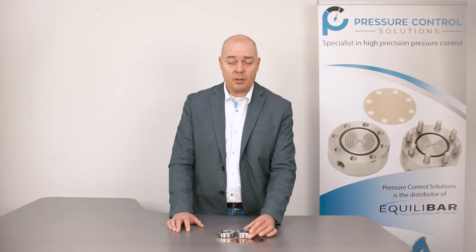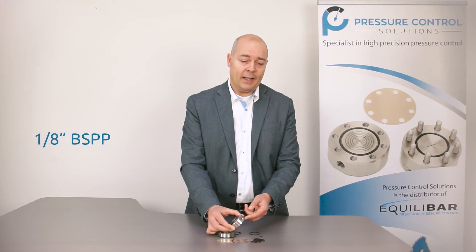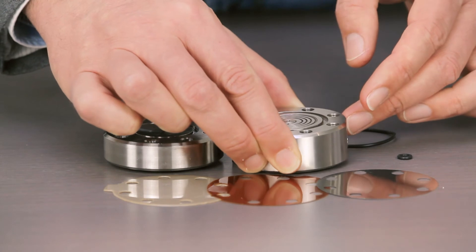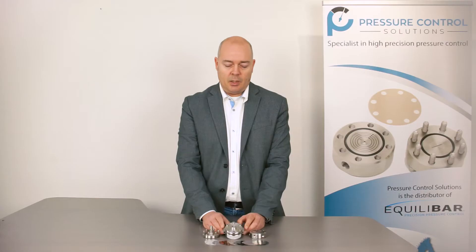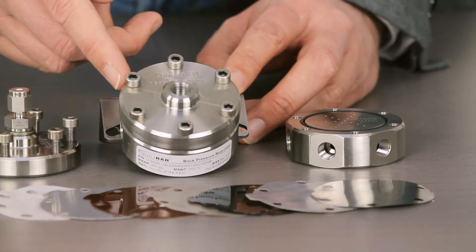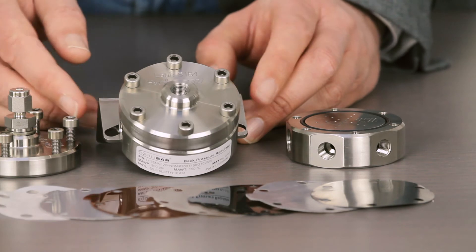The pressure rating of the ULF series is standard up to 200 bar. In this construction, there are also units available up to 400 and up to 700 bar. This particular unit has a 1/8 inch BSPP connection. They are also available in NPT. The standard product is made from a stainless steel body, Viton O-rings, and contains a PTFE glass laminated diaphragm.